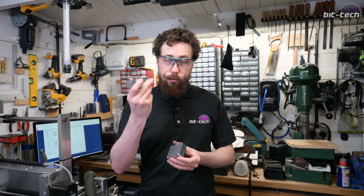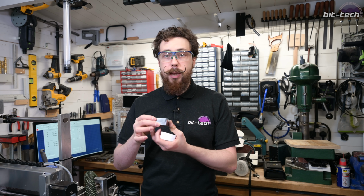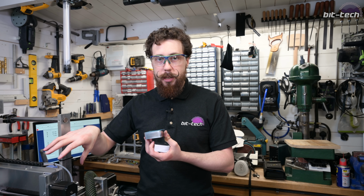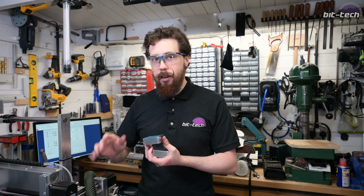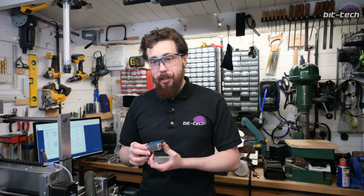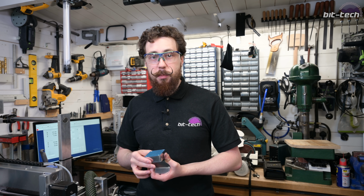But because they're the correct dimensions on the outside, I can use them for locating in the second operation sort of zone on the little fixture plate. Now, I did notice a tiny little bit of flexing. I did expect that, but unfortunately, two of the holes that I drilled were in the wrong place. Can't really go and fix that now. It's baked into the design.